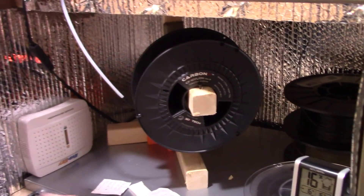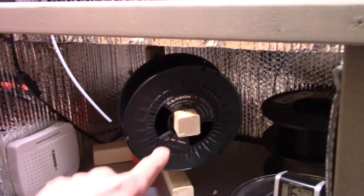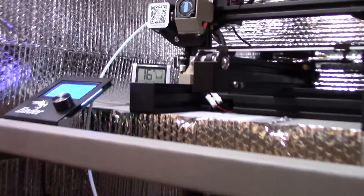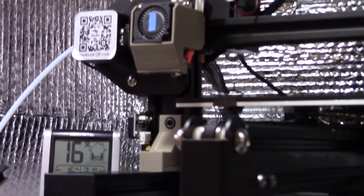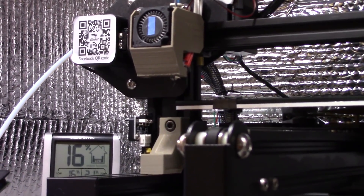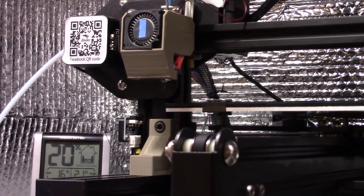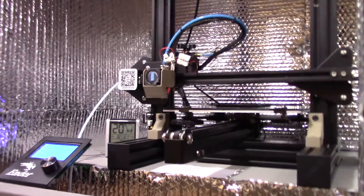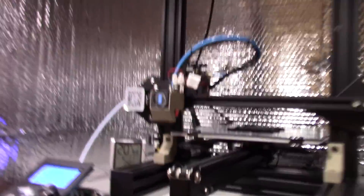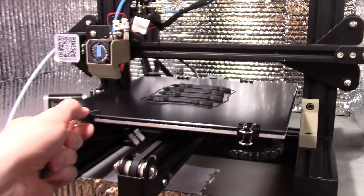So for this last week, I decided to take this as a good excuse to try messing around with carbon fiber. This is carbon fiber nylon. To do that you need a special nozzle. Inside of here I actually have an A2 — it's basically an A2, that's a tool steel — with an extra hard surface hardening technique that they put on it, so that it can endure the carbon fiber that runs through the printer. What you get out of that is a very stiff plastic part.